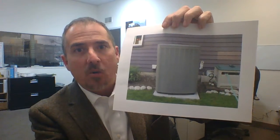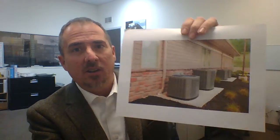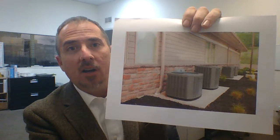If your unit looks similar to that, there is absolutely no space to anchor a cage to, so that one is certainly going to go into the ground. Contrast that with something where it looks like there's concrete all the way around it — in that case you could anchor the cage right to the concrete.